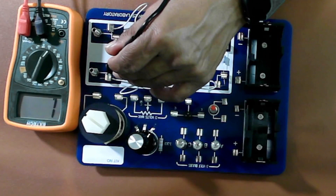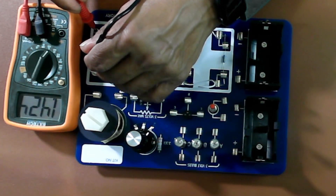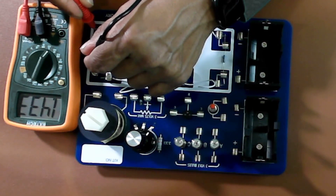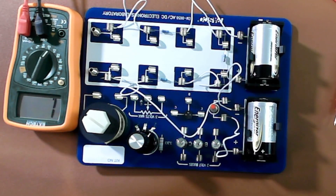For R123, place the multimeter between these two points and read the measurement. It's 1.433 kilo-ohms. Do remember that all of these measurements were taken without connecting the battery.